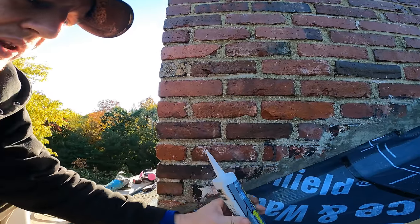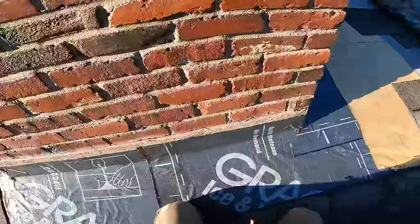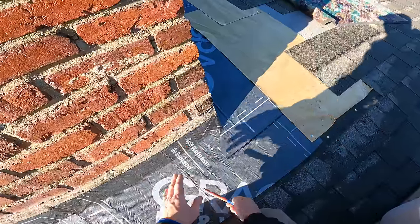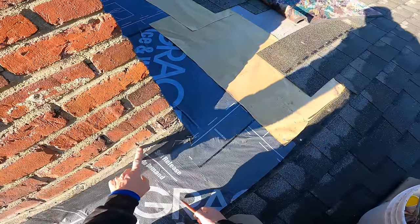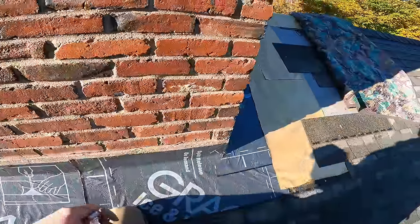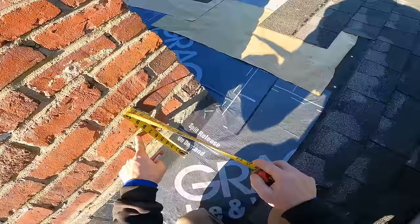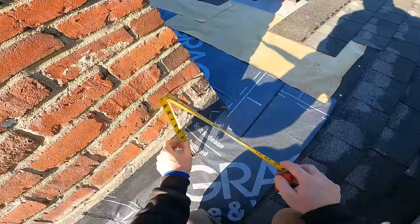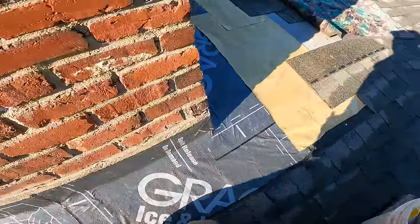Before we do any cutting, we're going to go around and figure out at what heights we want to do our cutting. I can't cut any lower here — I don't want to put lead flashing down here. I usually use eight-inch lead, and I've got eight-inch lead here. I can't go on top of that one because that's eight inches from here to here, and I still have to get my lead to turn and go into the joint.